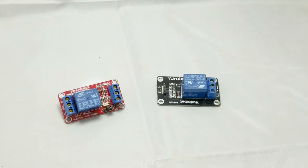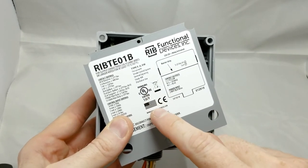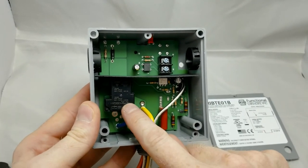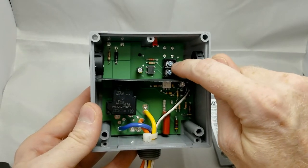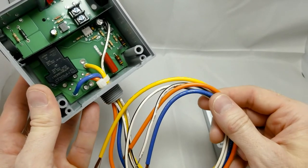Because I will be controlling an AC fan using an Arduino, I will need some sort of relay. At first I considered these very inexpensive relays from China, but I quickly had the realization that this was my house we were talking about, and I didn't want to put the safety of my house in the hands of a $1 eBay component. I decided instead to use this Functional Devices home automation relay that is UL listed and made in the United States, and it didn't end up costing that much money either. As you can see inside, it's got a very hefty relay, and the DC and AC side are completely isolated, so I connect the Arduino to these two terminals here, the power and fan to these wires here, and we'll be in business.